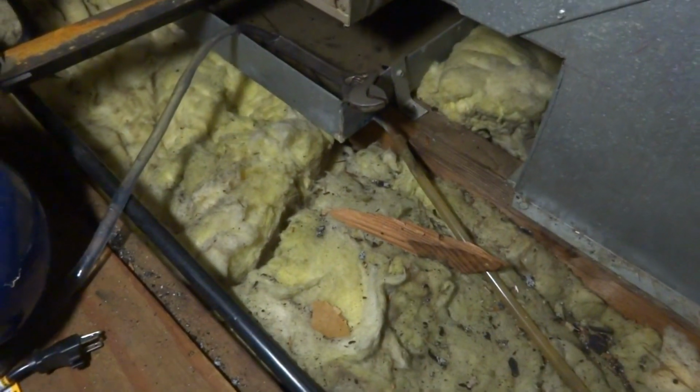Must have iced up. I did vacuum that pan out. Change the filter. Alright, no Taj Mahal here, mama. We got Armstrong. It's an old unit, man. It's an old unit. Yeah, might get another year out of it. Drain, pick up my hose and get out of here. We'll check the charge. It's running out there. Let it stabilize.